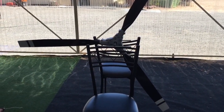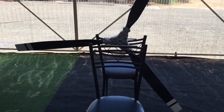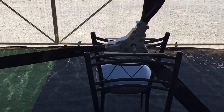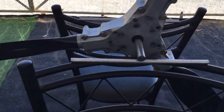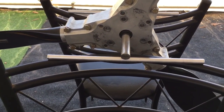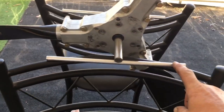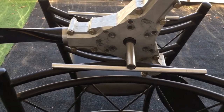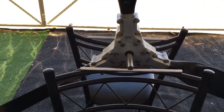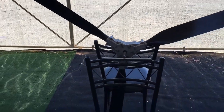By far I find this a much better way to balance the propellers. I've just got two bits of polished shaft — the lower one is alloy, the upper is stainless steel. The lower shaft on both sides is dead level; it works like a bearing. You don't need much force and it will roll very freely.